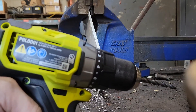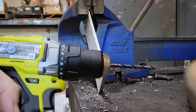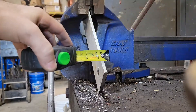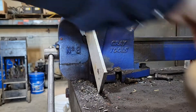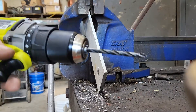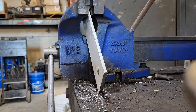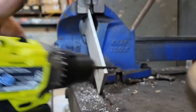I'm going to use the PBLDD01 and I'm going to drill a half inch hole into this quarter inch steel plate. I'm going to start with this bit here — that's a 15/64 — just to see how fast and well it can do it. I'll do this bit at speed 2.